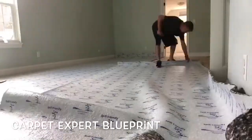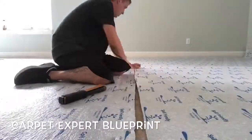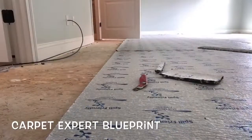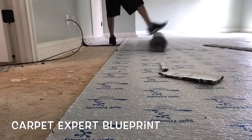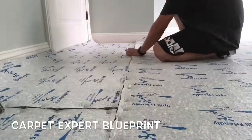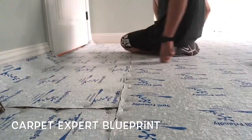Now we're in the master bedroom — it's clean and ready to rock. We're going to lay some good spill-block padding down and install it with padding staples, a roofing stapler, or pad stapler — whatever you want to call it. Go ahead and secure everything to the plywood subfloor; staple, staple, staple. The thing about installing pad is it doesn't have to be perfect as far as seams go, just as long as everything's lined up and tight. It could be a Tetris disaster and it'll still work fine as long as everything is adjoined.